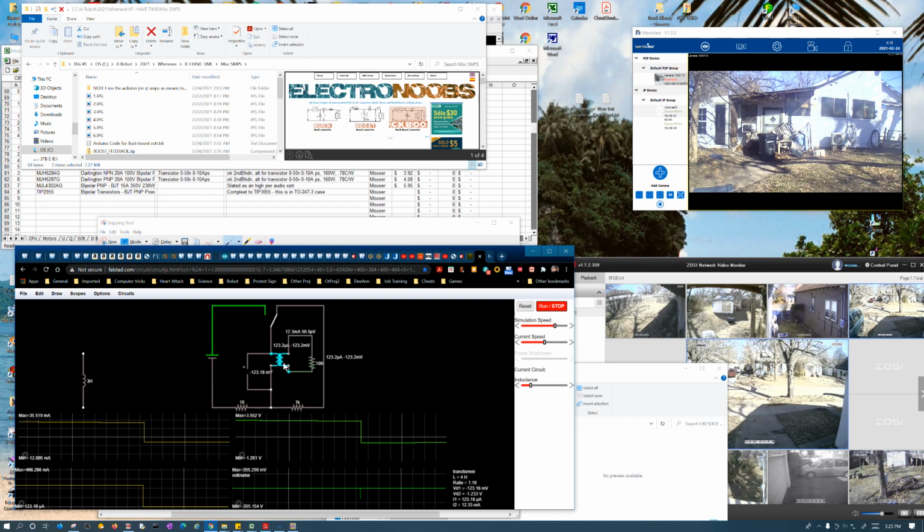I was making a prediction that if this had a 1 to 10 ratio, this would put out a higher voltage if it was going through a higher impedance than it was charged with. But it essentially isn't. Again, I expected the current through this resistor to be 10 times what it was through here. But it's not. It's like a tenth. So why would that be? I would expect that if this were 10 times the voltage, then it would have a tenth of the current. So I'm wondering if the ratios are wrong, but if the ratios are backwards, why isn't this a really high voltage? It should be like 50 volts then, not 5 volts. So what's up? I don't know if this makes any sense at all.